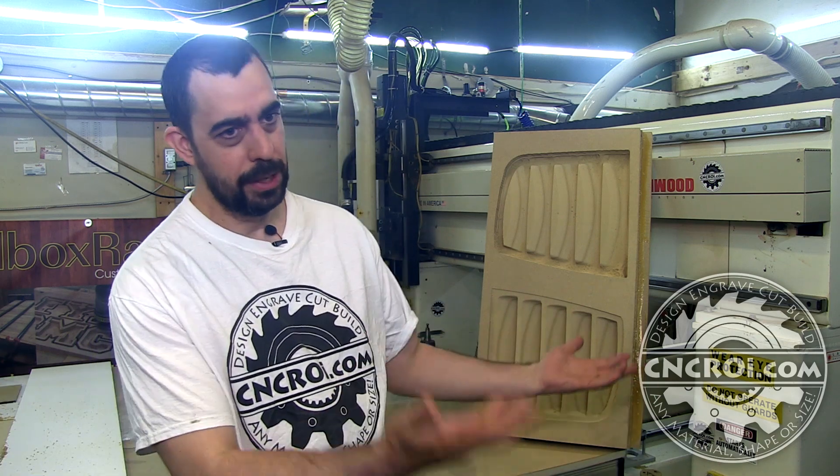We make them out of MDF and then seal and fabricate it so that it lasts roughly around a hundred units — if it lasts more, great; if it lasts less, the customer knows this is MDF and that's the purpose of it. The biggest issue with molds is repeatability — they degrade slowly over time. That's why generally you make them out of aluminum or something stronger, so that it lasts longer. They still wear out, just in the thousands or millions of units rather than around 50 to 500 units.